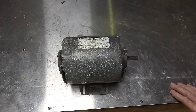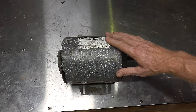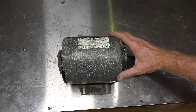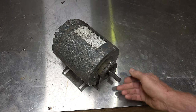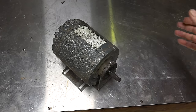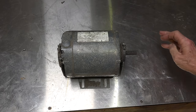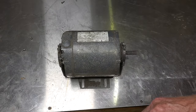In this one we're going to talk about centrifugal start motors. Most of them are similar in their design — they don't have to be. They're usually fan duty motors; belt drive fans are very common for these. They can be two-speed, but most are single speed, and the RPM for a single speed is usually 1725.